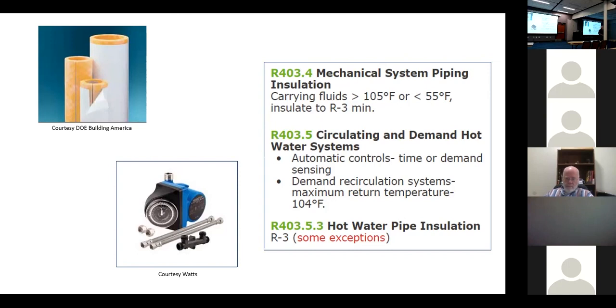What's Legionella? It's bacteria that grows in stagnant water. In warm water. Warm stagnant water. So we have water sitting in this coil all summer long, but the pump's not running. And so it sits there for 4 or 5 or 6 months in that piping and that coil until it gets cold and someone turns the thermostat back to heat.